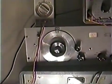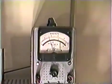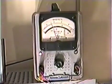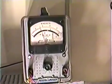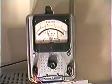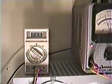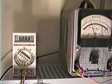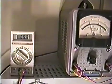And that would be at 45 volts if you wanted to use 45. I'll use 10 volts. The maximum voltage that this little oscillator can put out is 45 volts. However, as you can see, we're only using 10 volts, right here on the scale. So we're using 10 volts, voltage to the grid. Right now we have 29.3, very stable microamperes on the grid,